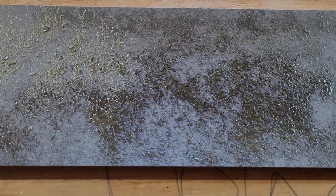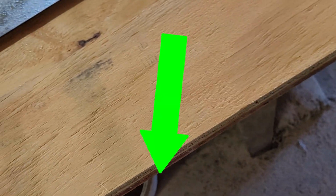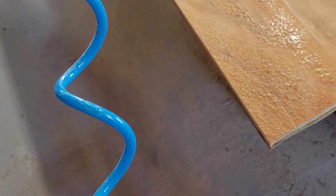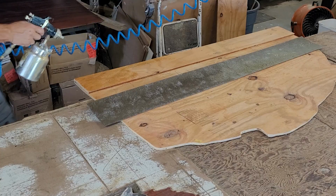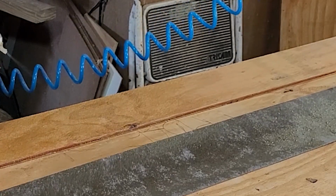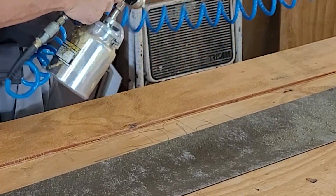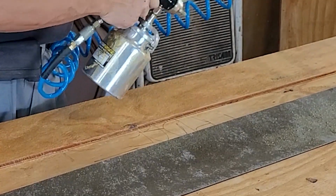Guys, that's what a close-up of the spray looks like. It's about 90% to 100% covered. Since I'm gonna cover that edge, I'm gonna spray this way so it doesn't get on it. So I'll tell you, the manufacturer recommends that you spray 100% coverage on the edges, and then you can go 80% in the interior.